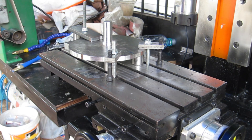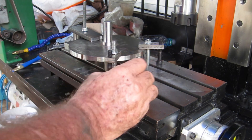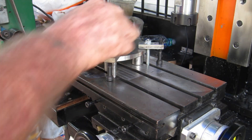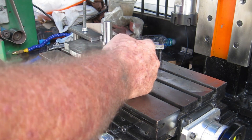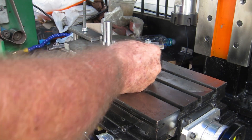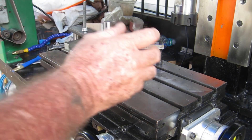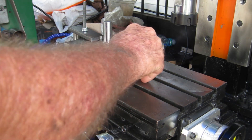So you may recall yesterday when I mentioned it vibrates a bit. This morning I went right around it and measured it everywhere to find the thickest and thinnest point. This here is the thinnest point. What I'm hoping to do is balance it a bit by putting the tool and another piece on the top here to hopefully balance it out, but we'll see what happens.